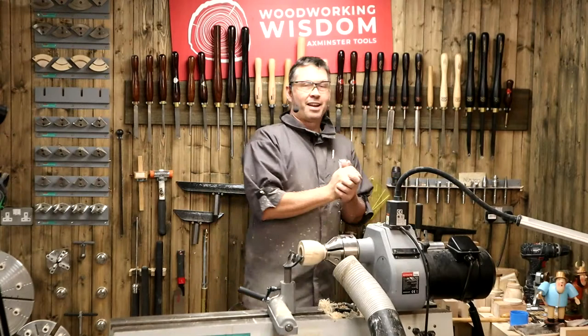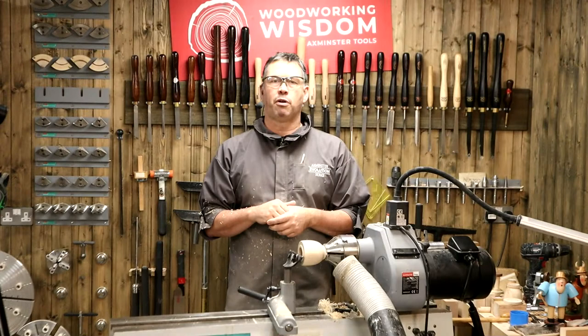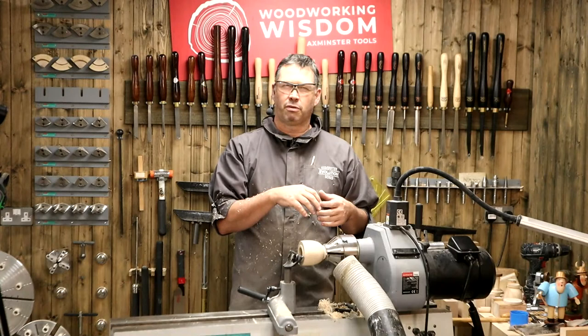And Robert would like to know, what speed are you running your sanding disc at? Sanding disc is about 1,000 revs at maximum, down to about 800 if I'm a bit twitchy and it's a big disc, for instance. I've got a couple of 300mm discs, so I'll run at about 800 revs.